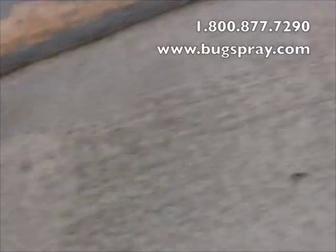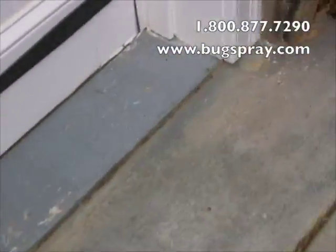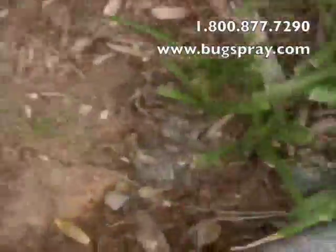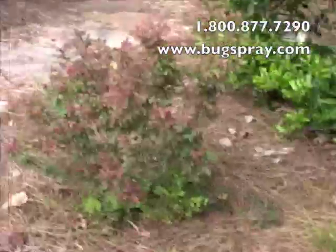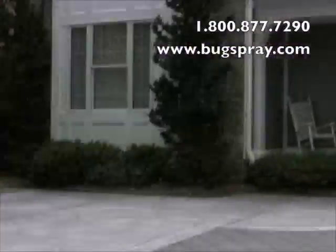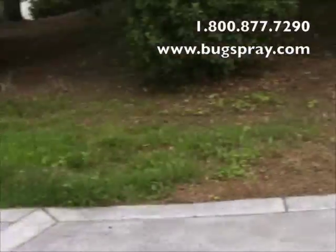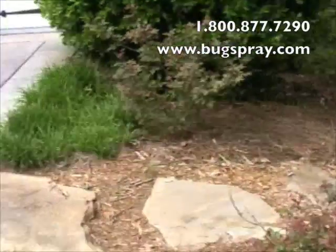There are stragglers, as you'll see, and they're going to be trying to set up new nests. Many times they get separated from their colony and that's not good for them — without the support of their colony, in most cases they're going to die. But just as a safeguard, in a case like this I always like to get extra treatments surrounding the property, and I've done that. I've put out the advanced carpenter ant granules in this situation and I've also sprayed the structure at the foundation with a cypermethrin, so that should help keep them out of the house. I'll come back in a week, look the property over for any activity, and do a follow-up treatment if needed. But I'm pretty sure I knocked out what was here.